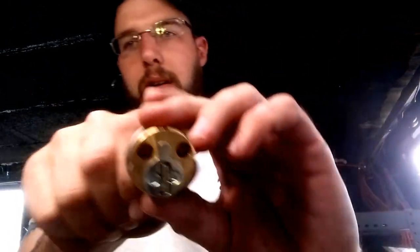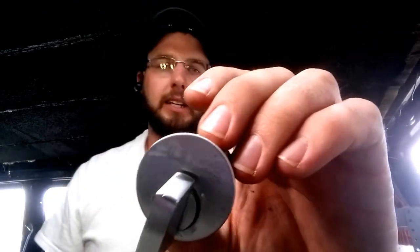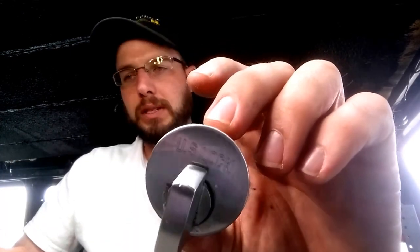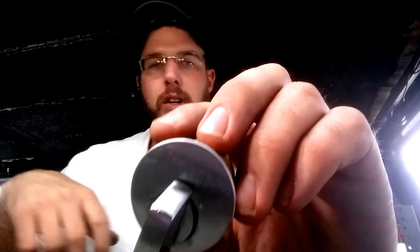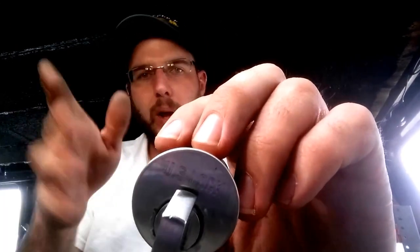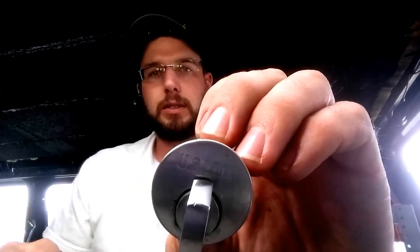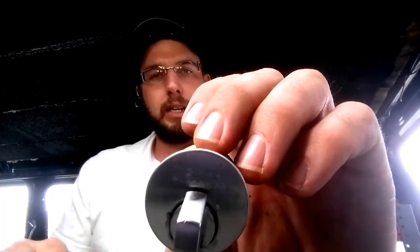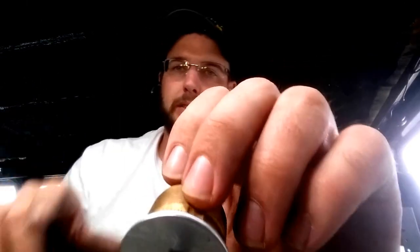That's just one of those weird things you're going to run into in the field. Due to the environment surrounding this unit, the solution was to force it over, get that ball bearing to drop in there one more time, pull it out, lubricate everything up. We noticed the corrosion, put the good thick Teflon lubricant in there, and the customer should be happy. Thanks for watching.